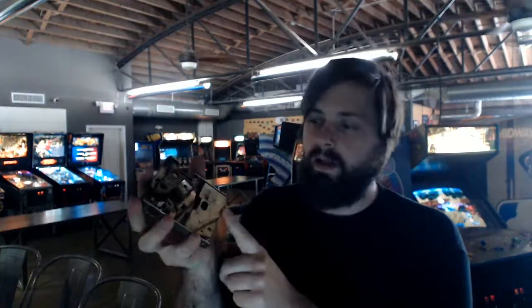So what I'm trying to say is the purpose of this video is to kind of let everyone know before you stick something in, realize that this right here is not smart. It's not like going to, let's say, a vending machine and putting in dimes and nickels, because that doesn't work. It literally takes in the money, it weighs it with this little mechanism right here, and then it dumps it appropriately out to a coin switch, which will register the credit, or it will dump it into the coin return.